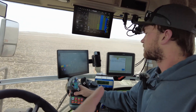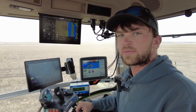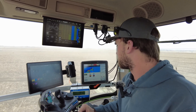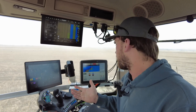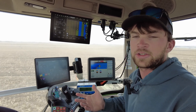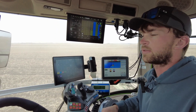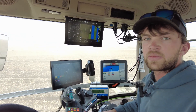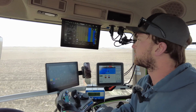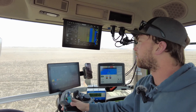So we've got the John Deere 2630 put in here in this Fendt tractor. Does it integrate pretty easily? Oh, it was a breeze — I just had to go over it this morning, make sure everything was compatible and talking to each other. I made one minor change and it was good to go. I was concerned about it to start, but I'm very happy with how it turned out. The AB lines that we got going here, those came over with the monitor? Those shifted right onto here, no problem. It's very, very simple. It was a major concern at first, but I'm happy it's all working well.